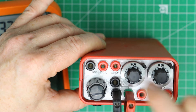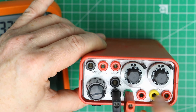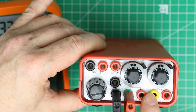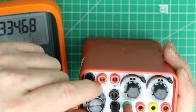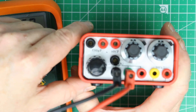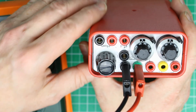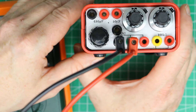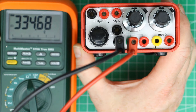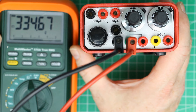This one is also easier to build — just two 10-turn trim pots, a few banana sockets, and a variable capacitor. That's a project for one or two weekends. It's even quite easy to build for beginners, and you should always have one at hand when it comes to probing out circuits where you have to find the right combination of resistance, capacitance, or inductance.